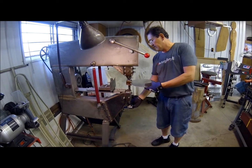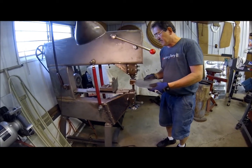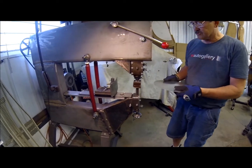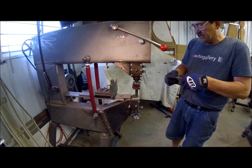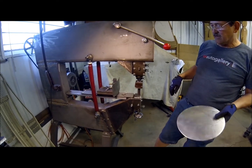We set the basic gap so it will allow the metal to shrink. I'm going to run this one — work it in just like I did the steel — but you'll see the aluminum moves pretty fast.